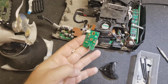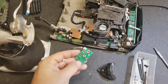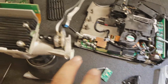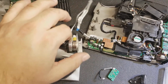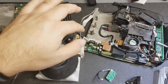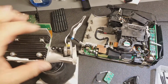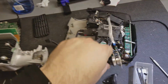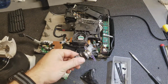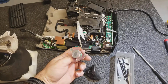Has the position sensor in there, has an infrared thing right here that monitors the index mark, that little black mark. So it's reflecting until that mark comes by, and then that sends a pulse and tells it that the index mark has gone past, and that's set up in the software to tell it where it's at. So it just slides off, and yeah, it's seen better days.